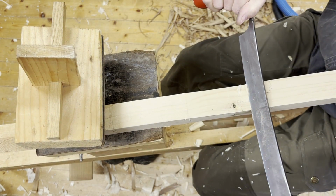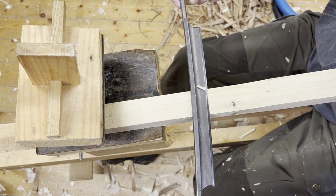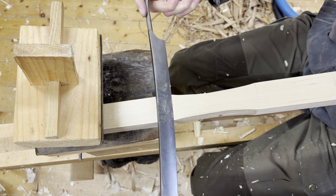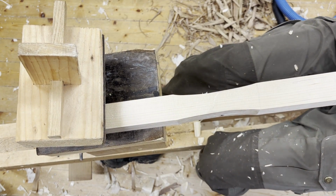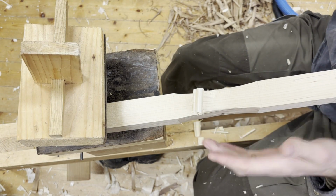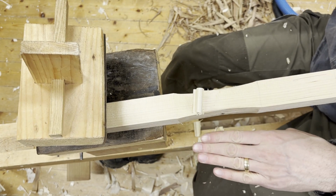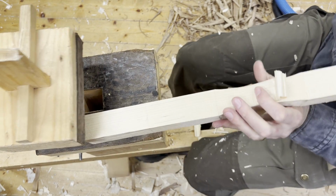So there's some benefit to your back bevel, but it depends on the kind of work you do. This is a radial plane, or close to, and it's cutting differently, as you're not cutting into different layers of growth rings, but they are vertical and you're just slicing into them.